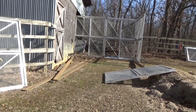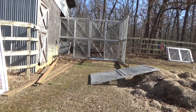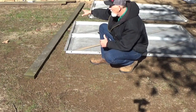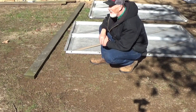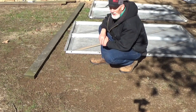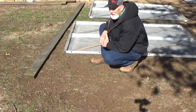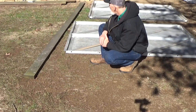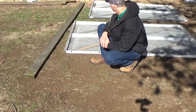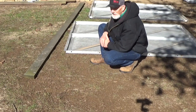We made a final decision on what we're going to do with the greenhouse. We had to deal with different size panels — beggars can't be choosers. This slope is pretty severe, off from the west all the way over to the south. This is not going to be a permanent structure, so we don't have to be too careful, but we do want it level and square. I was able to get my hands on some old treated 2x6s; that ought to work just fine for the footings.